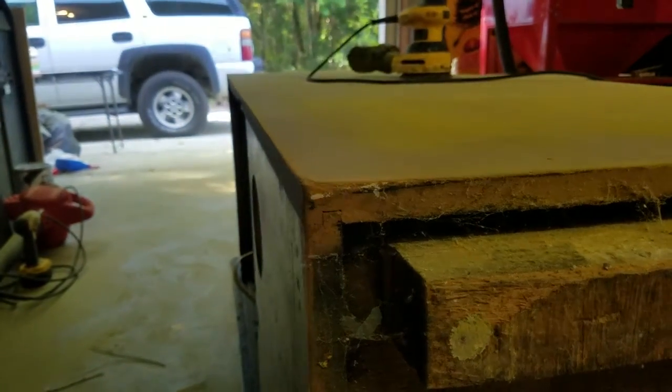It's looking pretty good. As you could see before, there were some divots and stuff. Now this top stuff, that's just where it was swollen before, so a little skim coat of Bondo. What I'm talking about is look how sharp that edge is all the way down where we just did that. There were nicks and cracks and all that. It looked like this before. See how it's all wavy and all chipped out? But now it's nice, straight, and flat.